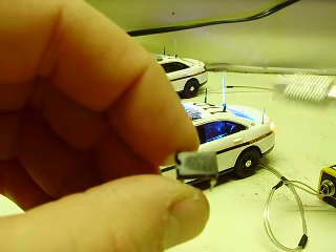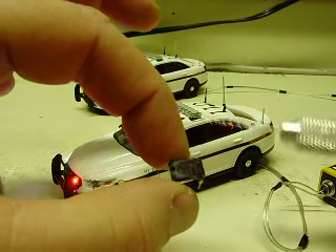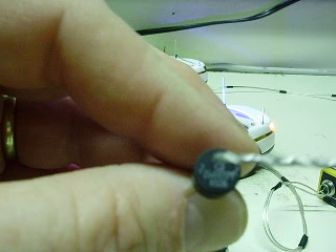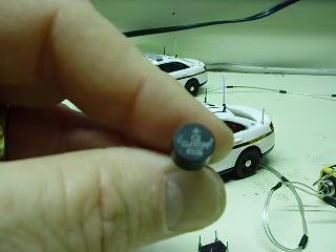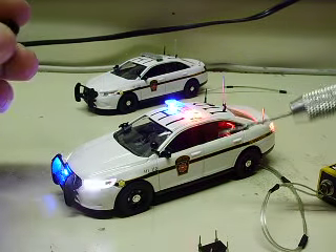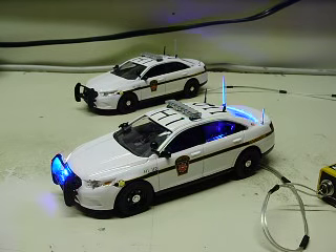You still have to observe your voltage on these. I had to step up from running on a regular 9-volt battery — I had to step these resistors up to a 560-ohm resistor to limit the current and voltage going to the LEDs so it doesn't mess them up. With these bridge rectifiers, what it will do — you can see this one here — you've got your plus here and your two sine waves on the sides, so that is where your power goes in. You can put AC in through this. Your car hooks up everything normally, and if you have a car already running on DC, you can convert it to AC. You just need to change the resistors out so you don't mess up your LEDs. Quick little tutorial on the bridge rectifiers.